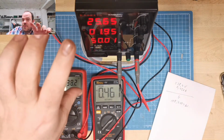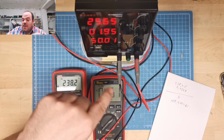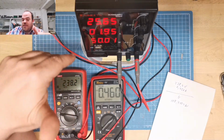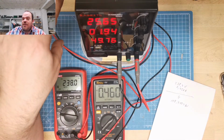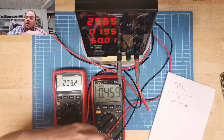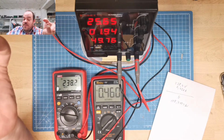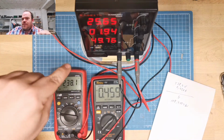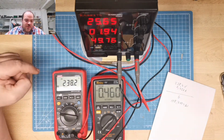So, especially with switching power supplies, I don't think it is 100 watt, because then the fan would already need to run. Because the 50 watt that I don't get out of it has to be converted into heat inside. That is why my other power supply is so loud, because it's more like an ohmic, resistive load because of the transformer inside. But a switching supply should not do this. So I'm not sure. Leave a comment if you know or how I can measure it.